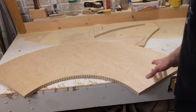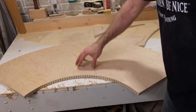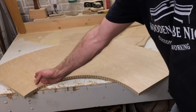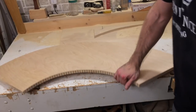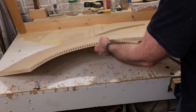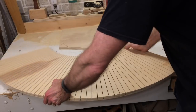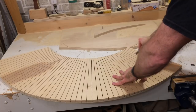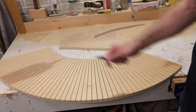Because I've got such a large curve here, I've got grain going different directions. I've purposely set it up this way so I can get the grain going at a 45-degree angle. But here the grain is going parallel to those kerf cuts, and over here the grain is going perpendicular to those kerf cuts. That means this side is a lot more flexible than the other. I discovered that if I take a sharp knife and run it in these grooves, that's all it takes to get that groove as flexible as the ones at the other end.